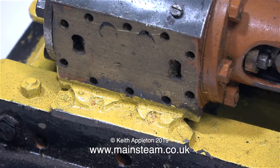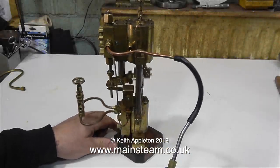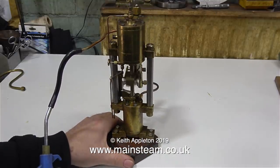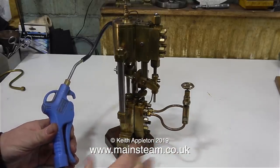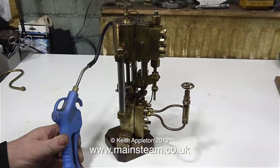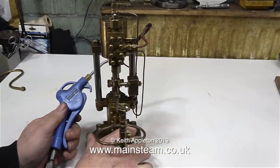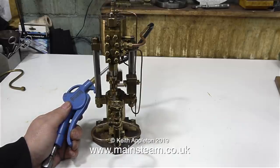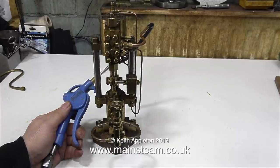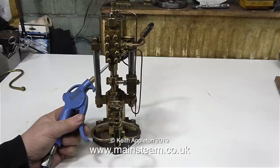The next engine I'm going to show wasn't bought via the internet. So why am I showing this in a video all about buying off the internet? Well, it's a little bit like a lemon sorbet between courses — just here to refresh my visual palette before the final offering. This is a freelance steam pump built by my friend Don English, and it really does run very well. It's not built from castings though, it's fabricated — a bar stock engine in that sense — but the parts are silver soldered together before machining, and I don't mind that approach.